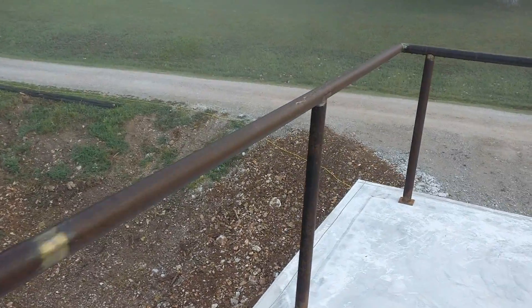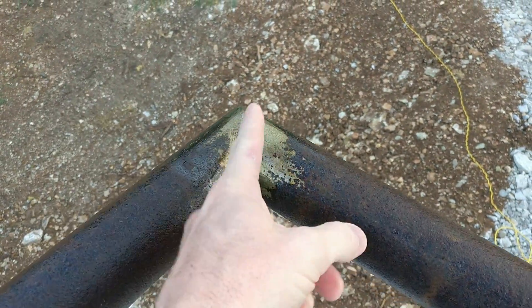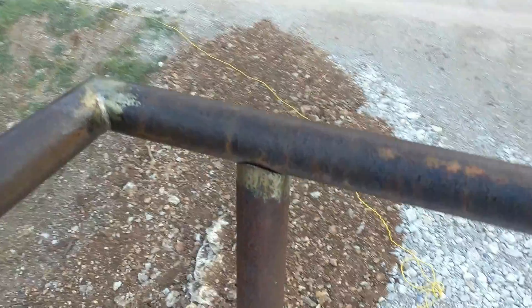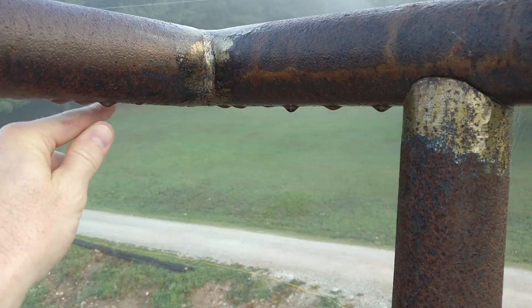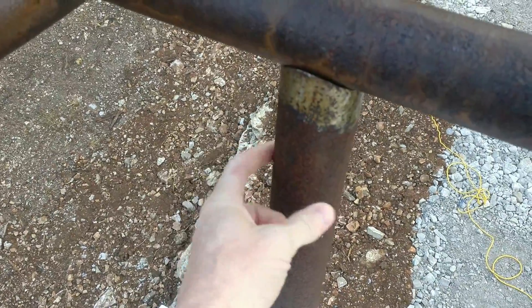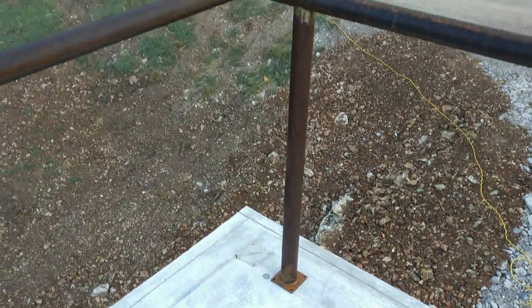Over at the corner — I cut my 45s, clamped it on there, spot welded it, ran a bead of weld around it, came back and did a grind, and I'm very happy with it. This particular corner piece is not welded yet because it isn't my actual corner. The actual corner will be at a different level because I have a saddle going both ways, so those four corner pieces are going to be special cuts. These are just there temporarily just to hold the corner and keep it from dipping down.